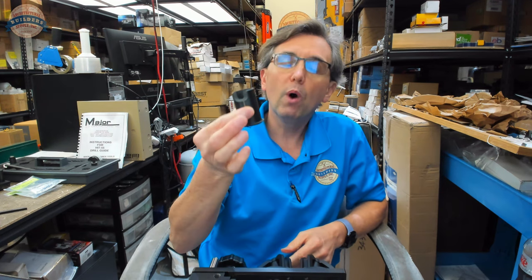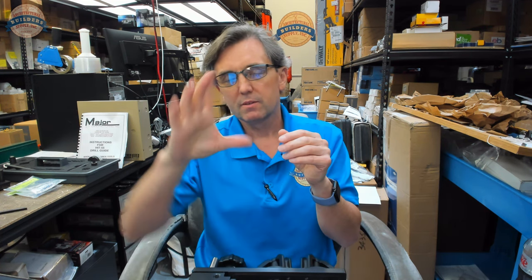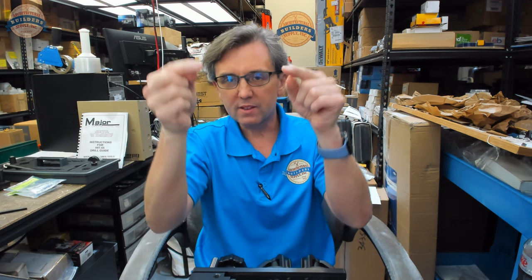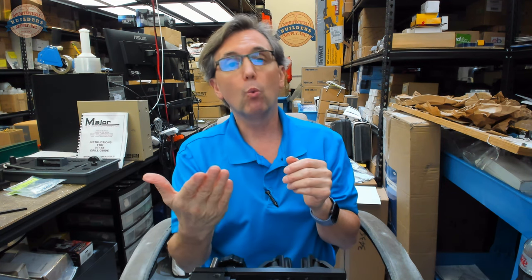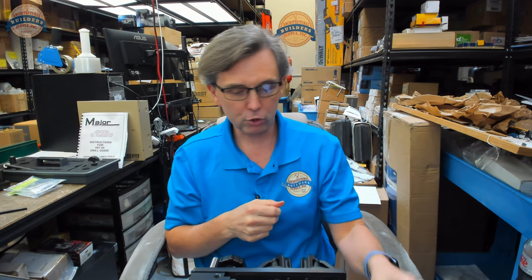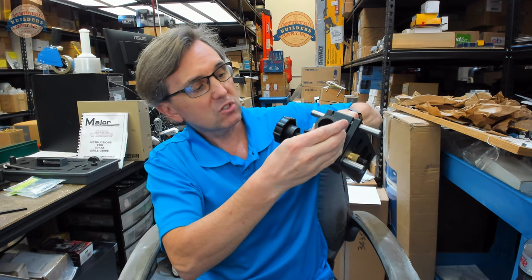You can always drill 1 inch, but 1 inch is a little bit funny when you have a 1 inch wide latch bolt, in the sense that 2 1/4 by 1 inch, right in the center at 1 1/8, you can see a little belly sometimes. That's when you really do want to use that smaller bit. You would use a 1 inch when you're doing 1 1/8 wide latch bolts, which would be typical for commercial work. So what happens here is this just slides down in place.